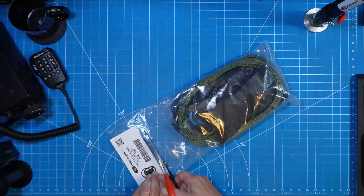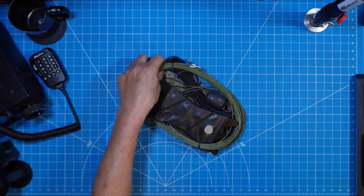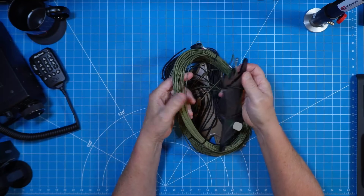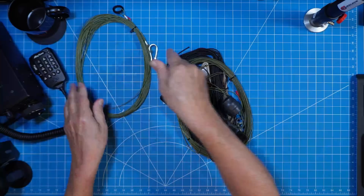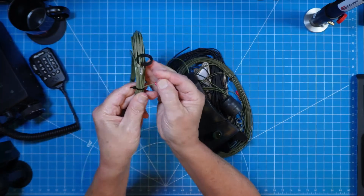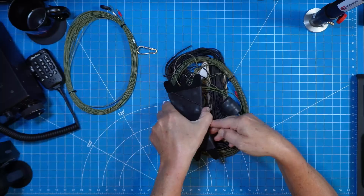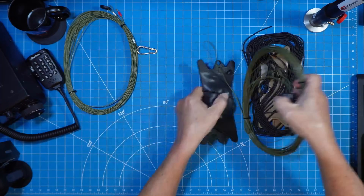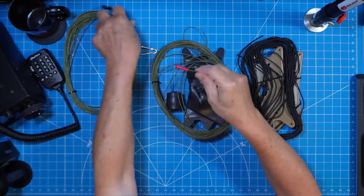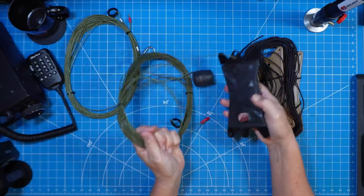Before we go backyard portable, let's look at the contents of the LEFS 8010 so we can pre-plan the setup. It is a very straightforward and simple setup. This is the 67-foot section that allows us to get on 80 meters — it has a connector. Attached to the matching unit is the 63-foot section of wire. This is what lets us get on 10, 12, 15, 17, 20, 30, and 40 resonant, and then we connect the two wires together to jump up to 80.